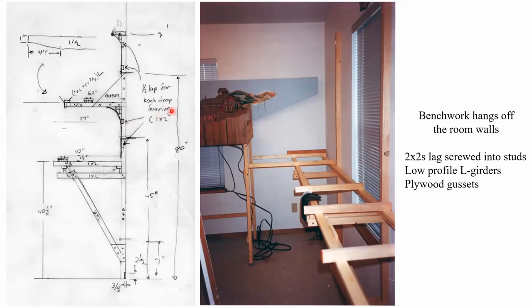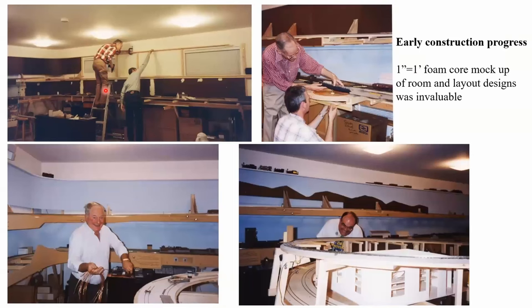People are always wondering how this thing was built. This drawing shows 2x2s that are lag-screwed to the wall, braced from below with another 2x2 held in place with gussets at the bottom. We're using 1x2s for most of the framing because the deck work needed to be thin. This plate rail above has a dado in the bottom into which Masonite backdrop was forced up, keeping it in line, then screwed to the 2x2s and finished with drywall mud.